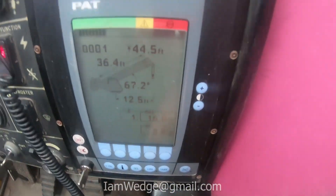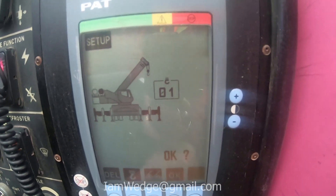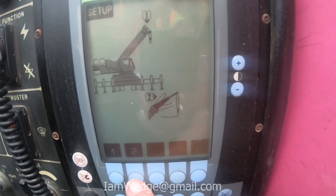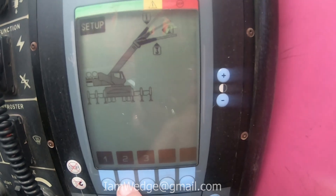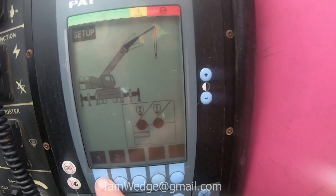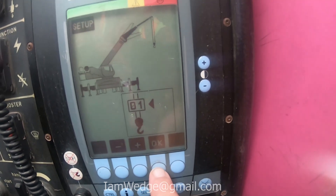First of all, let me show what the crane is set up for — I'll get down close so you can see. I'm on number two, which is this one, and number two up here. This is the 25-degree offset, so I'm back on number two. I'm on the main drum, and it's fully extended. I have one part of line.